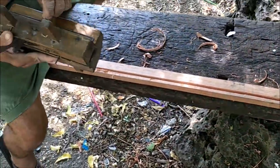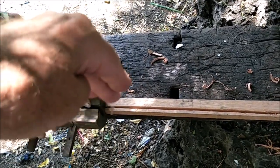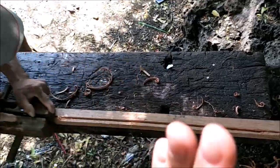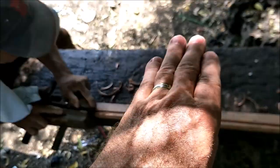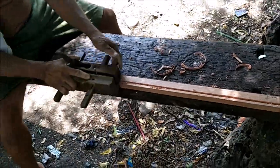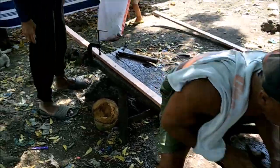What's going on here is we're grooving this piece of wood here. You see that groove he's putting in there with his planer? That's so that on the top side, the quarter inch plywood slides inside there. And actually, the plywood's going up. And then they cap it with that. And that plywood goes inside that groove there. So that's what we're doing now, grooving this for the top. So we will be back with more